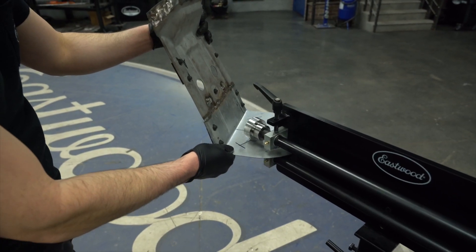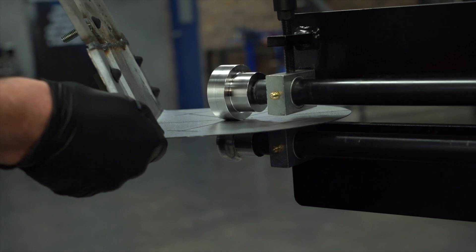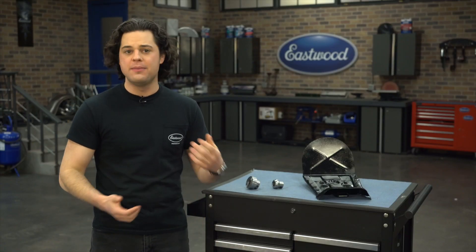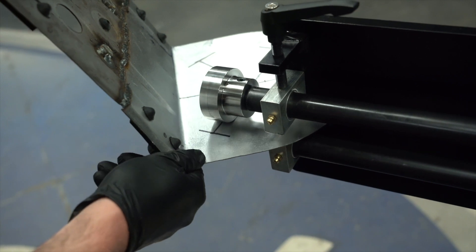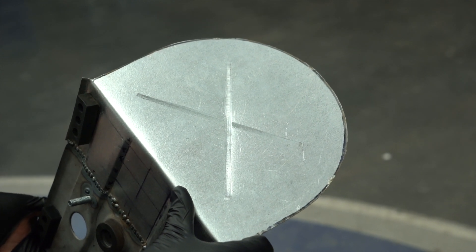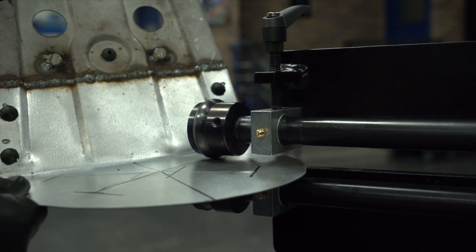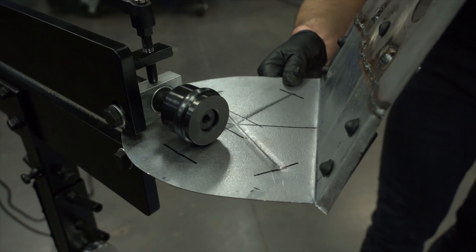That's very important to get your crown to work with your bead correctly. Rolling with them is super simple. I went back and forth in an X pattern maybe six or seven times for each line. It doesn't take much work with the stretching dies to get good results — a little tiny bit of crown in your panel will go further than you think. I only use medium pressure, maybe from touching the metal one and a quarter to one and a half turns on the crank. I like to stick to a box pattern, wandering a quarter inch to the left and a quarter inch to the right of where your bead is going to lie — that's all you want for a standard three-eighths inch bead. Keep in mind if you want to do something deeper, you're going to need more metal and therefore you should stretch accordingly.